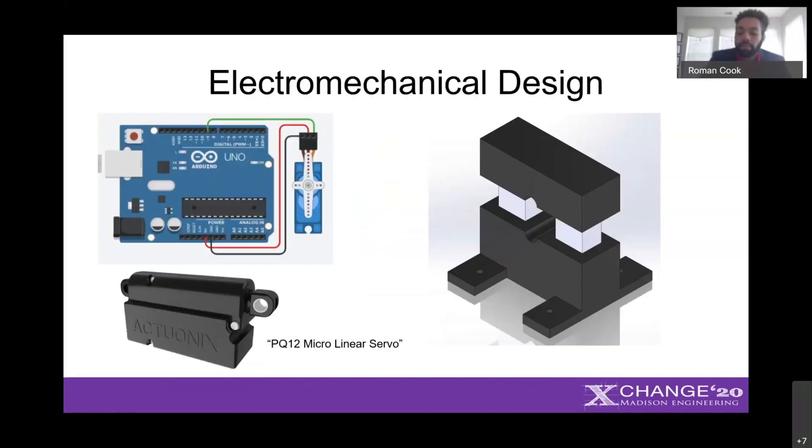The image on the top left shows the connections for our braking system. This subsystem continuously updates and checks wind speed values and RPM values that should trigger braking. The servo used for this subsystem rotates between 0 and 180 degrees, and the PQ12 micro linear actuator shown at the bottom is used for emergency braking. The e-brake subsystem uses two of these actuators to clamp down on the shaft when a stop button is pressed or when power is disconnected from the turbine. You can see the full system on the right.